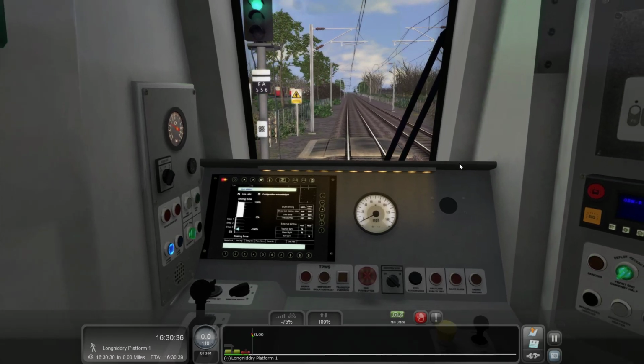As I said, it wasn't about the driving today, it's about reading. Note, if the button remains depressed when the master key is removed, there will be an audible alarm sound. To silence the alarm, you're required to reset the button. So to do that, you need to turn the master key on and then back off.